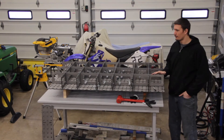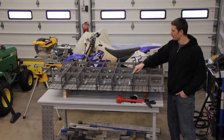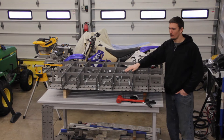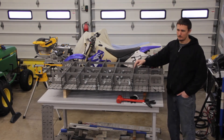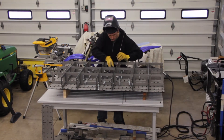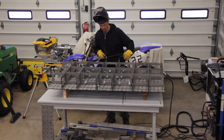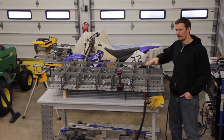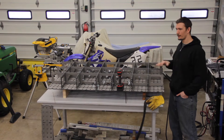I've gone through and checked for flatness and reconfigured some clamps so that I have an internal rectangle that's all flat and ready to go for tack welding. I've just finished welding the internal rectangle and now I'm going to move my clamps out and tack weld the outside of the table.